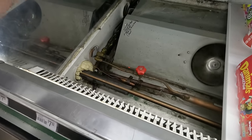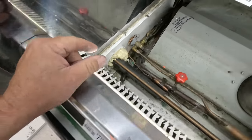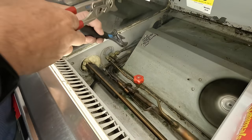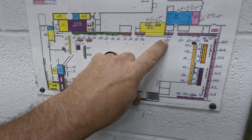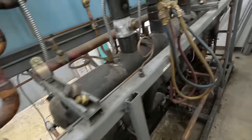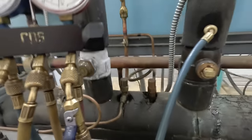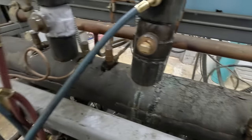There's our valve. I put a label on it — 'bad TXV.' Wait — that's 36C, and we shut down 36. That one should have been done and emptied already. I'm not sure what's going on. Oh — it was 36 all along. I did the wrong one. That's why I actually worked on both these circuits last time.